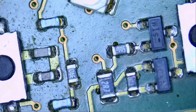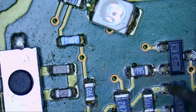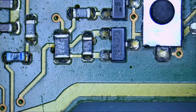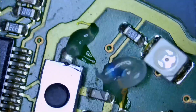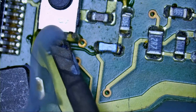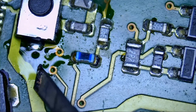Let's grab this Benz key fob board. Those components are considered big, but it's a two-layer board so it requires less heat transfer. We'll apply some flux on a big joint on the button and see the power of this mini soldering iron pen. Look at that — it just liquefied the solder, and look at that nice joint.